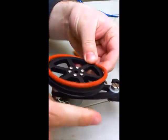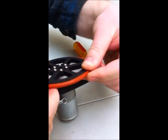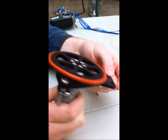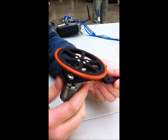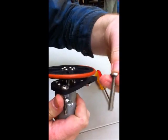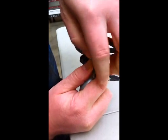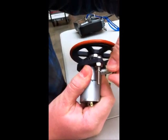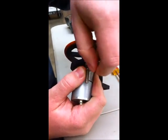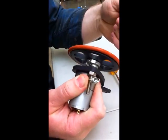The last bit is your tire — you have this nice silicone O-ring, and just snap it into the little groove there. Your motor mount kit is complete. The last thing you'd do is find a suitable spot on your frame for the other end of your dome drive tension spring, and this will just provide tension and stretch to keep the wheel solid against the rockers and bearing. That's it — I hope you enjoy your dome drive.